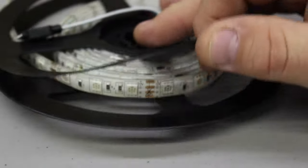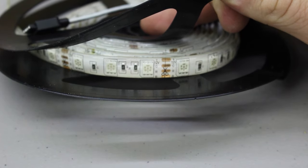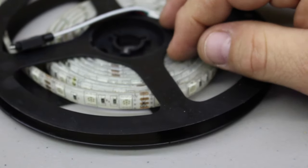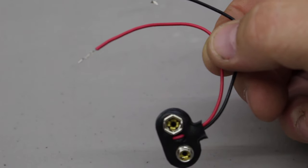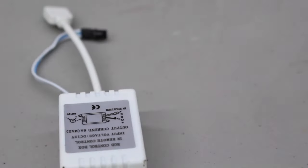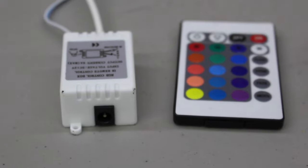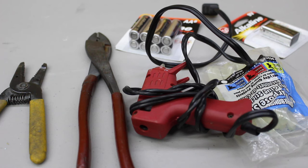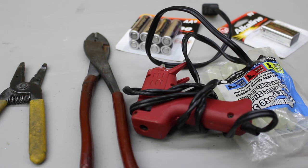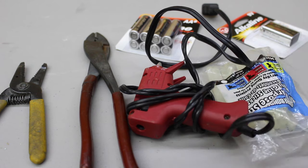These are LEDs left over from my LED golf cart whip antenna — you can find that video in the description. This is an 8AA battery holder. 8AA at 1.5 volts each equals 12 volts. We also have 9-volt battery snaps. When you buy your LEDs, you'll normally get a remote and a controller if you buy an RGB LED. You'll also need a battery DC power plug, found at Radio Shack, plus a few tools: a wire stripper, a crimper, a heat gun, some batteries, and a solder gun.